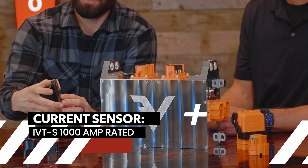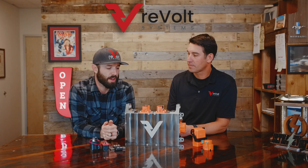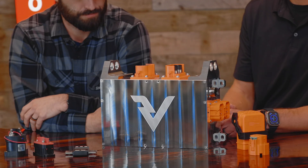What kind of current sensor? We have an IVTS. This one right here is what we have standard in our boxes — it's a 1000 amp rated unit. It has the same platform for a 2500 amp version as well, and there's also a 500 amp version. But like Eddie said, all the research has been done. We are using the coolest-running contactors and mini-tactors, and pretty much the highest-accuracy CAN bus current sensors we can find. Everything has been really well thought out. Pre-charge relays, accessory relays, full main contactor relays — basically everything you're going to need to manage your high voltages is in this box.